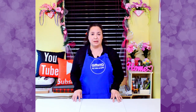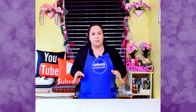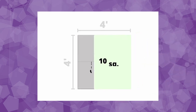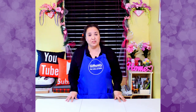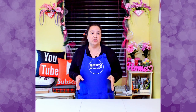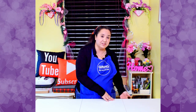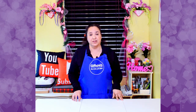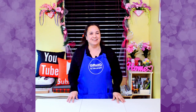Now here's how I save some space. When the sides are folded down, each table measures only about 17 inches by 23.5 inches, or roughly 1.5 by 2 feet. Combined, that's 2 by 3 feet, or 6 square feet — a savings of 10 square feet. That's like having an extra 5 by 2 foot table in your home. The key to being able to do all this is with these latches that I purchased from Amazon. These latches are installed on the bottom of the table's edges with small screws. Make sure the screws are small enough not to go through the table when fastened, and it also helps to drill pilot holes first. The latches hold the tables together and make them into one — no slipping or moving around, just like a single larger table.